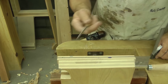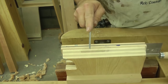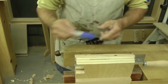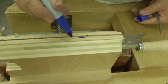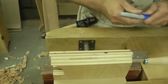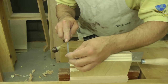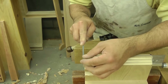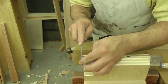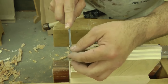That's going to give me a good aggressive cut. The easiest way to do that is to set a square on there and put the side of the file up against the square. Hold your finger right there so you know where that blade is in relation to your hand. You can also paint the teeth with a felt tip marker so that if you accidentally stop or lose your position you can tell which tooth was touched. Set the file perpendicular, place it in the first gullet, file once or twice, and always drag it back in the same gullet — because setting it back down in the same gullet after lifting is too hard. Skip over to the next one and do the same number of strokes.